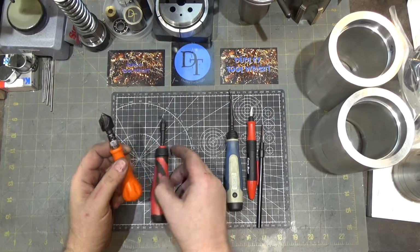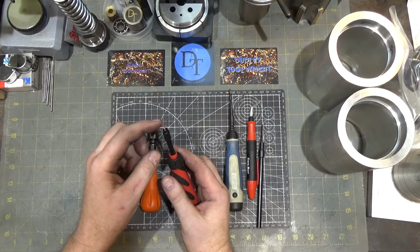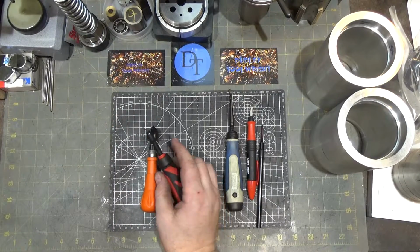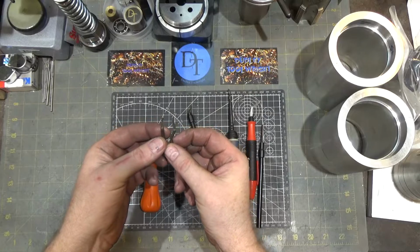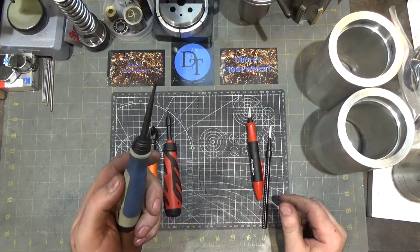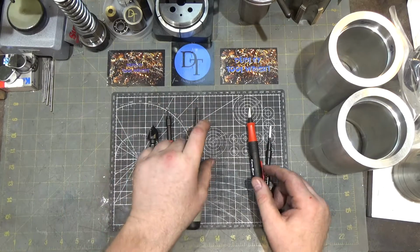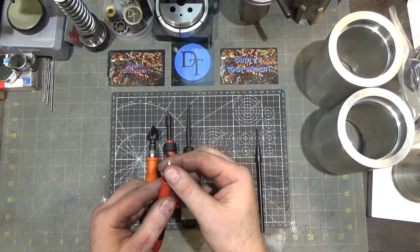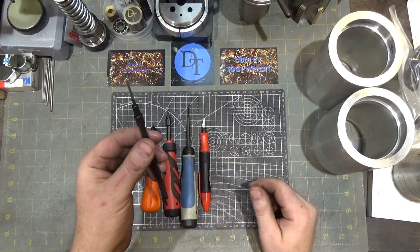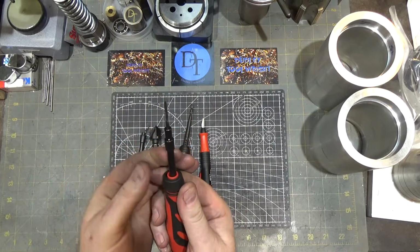Now, almost everyone's seen countersinks and the really common Noga or Shaviv style deburring tool. They have a bunch of different pieces that go on the end. This is a lightweight one for light materials. They also have different shapes for plastics and different purposes, and they often come in sets. A little less common one is a design of a deburring tool that lets you reach on behind and deburr. It's a little awkward to use, but it works reasonably well. This is a ceramic scraper style deburr, and it works on plastics and even soft metals like aluminum. And this tip fits inside this one here. So if you pull this out, it fits in there.